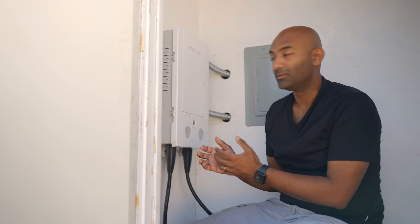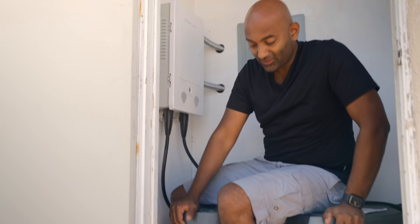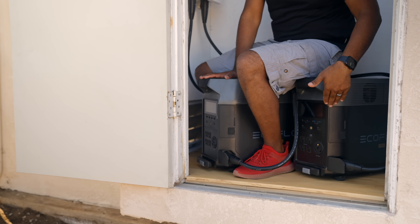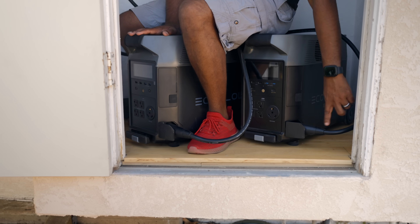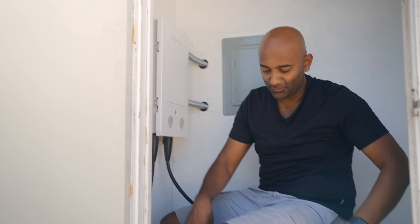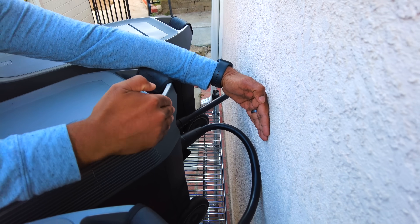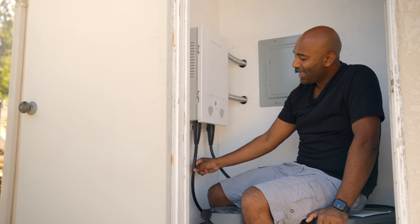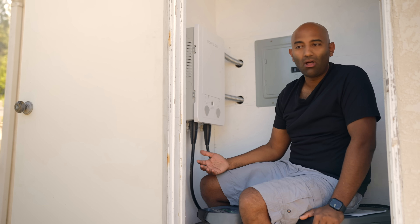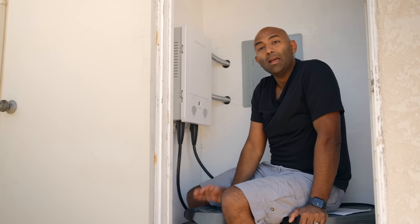Let's talk about the pros and cons of going with this system. You can get the smart panel and the battery separately, which is really nice. But these batteries do take up quite a bit of space — you need about three feet because the ports plug in to the smart home panel from the front. The battery cables that connect to the add-on batteries plug in the back, so you need a couple of inches behind the battery as well. Also, this cable that plugs into the infinity port has to be within six feet of the battery — this cable is only six feet long — so you can't have the batteries in some other part of the house. It all has to be together, as you can see in their diagrams. But if that scenario works for you, absolutely check it out.